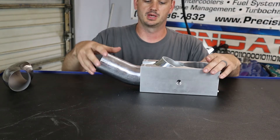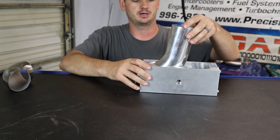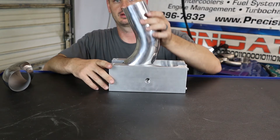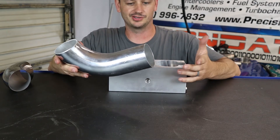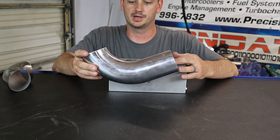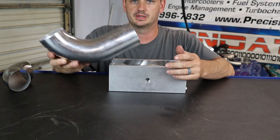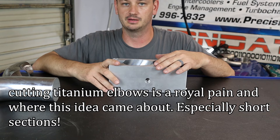Just as it would with this, but if you go in from this angle with straight here you're going to get to the point where you bottom out and it won't go any further. But generally speaking, when you have this large of a piece and this much straight section on it, you can just cut it in a traditional manner, or if you wanted to, you could cut the straight section off and use it.